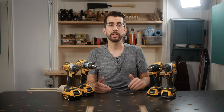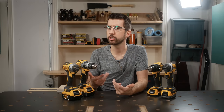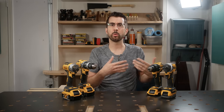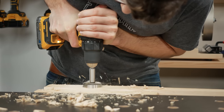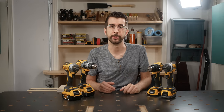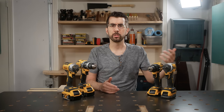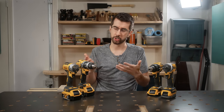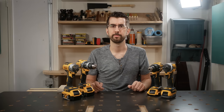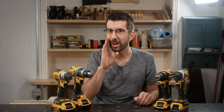I want to talk about the differences between this compact drill and compact driver and these more regular-sized ones. There's no difference, at least in performance for my needs as a hobbyist. The compact ones are more than powerful enough for drilling and screwing through hardwoods. I would be fine if all I had were the compact ones or even the lower voltage counterparts too. The ergonomics on these are far superior — they're just lighter, more maneuverable, and they can get into places where the larger ones can't. As for brushless versus brushed motors: get the brushless. Don't ask me why — you don't want to hear me talk about electric motors.